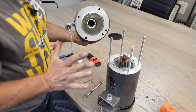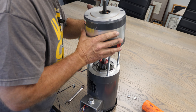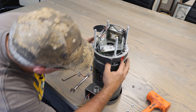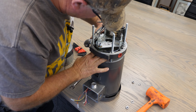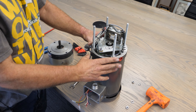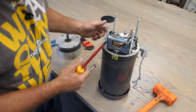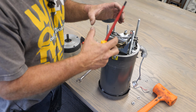Now I'm going to set this new brake back on. I have to line it up a little bit — get the first one, second, there it goes. Sometimes it doesn't line up quite right and you have to turn it a little bit. If it doesn't go on and you're struggling, on the backside there's a release for the brake. Take your flathead screwdriver and turn it up — that pushes the plate up so you can go in and move your plates around. Move them so you can get the keyway and the spider gear to all fit together.